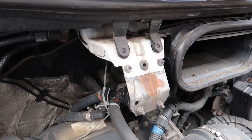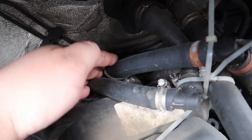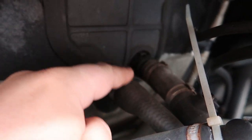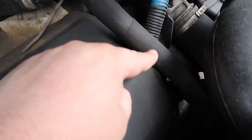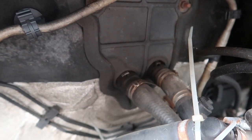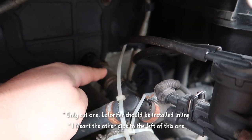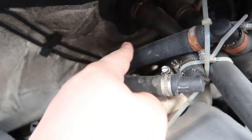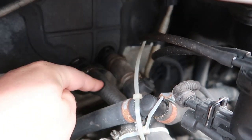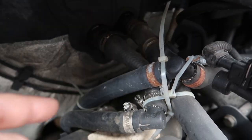This is the engine bay. Those two hoses go all the way down there and then come up here. You need two 90-degree elbows. Along the back of the firewall, these two hoses run into the depth of the engine - it's just coolant fluid coming up here to go into the heater matrix for the cabin blowers. All I did was cut one of them, put an elbow in - so this pipe here was going here, I cut it, put a pipe off onto one end, and that runs off to the calorifier, and then the return pipe comes back up and I put an elbow in there. Essentially fitting the calorifier tank in-line into the existing coolant system pipes.